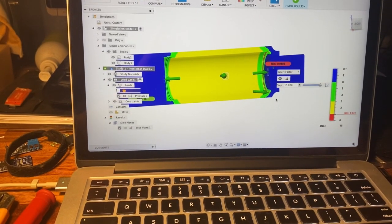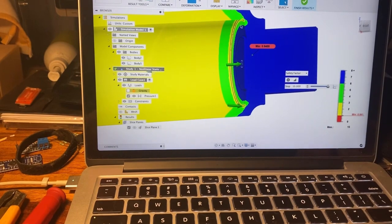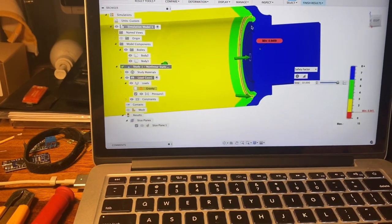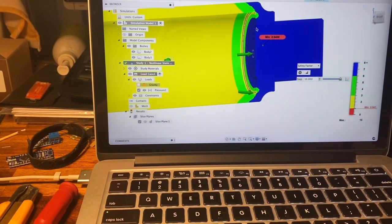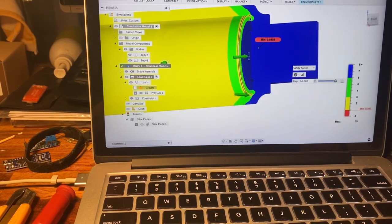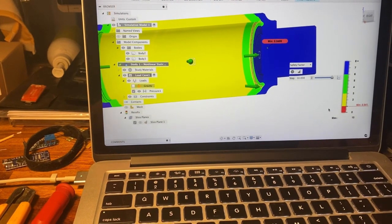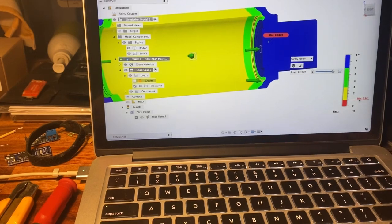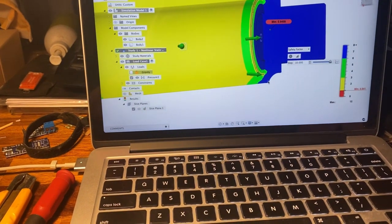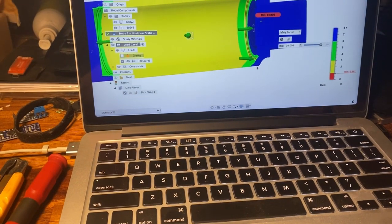I corrected my design about the Leshiy 2 original air tank, and because there was the Sandvik U-drill insert, it has a slight angle to it and 0.4mm radius in the corners. Considering all this and the material, the safety factor just on the surface is just below 1, so it's on borderline if it's yielding or not on the surface without any outside force into this end.